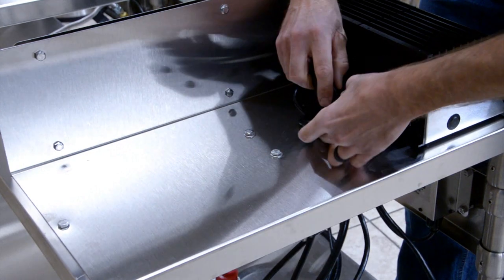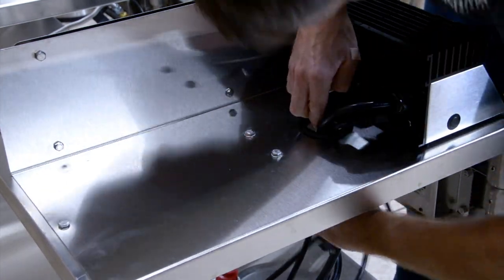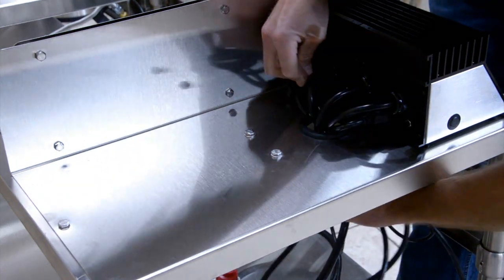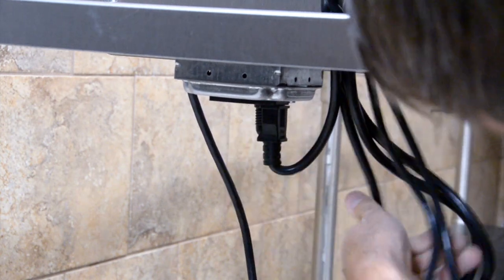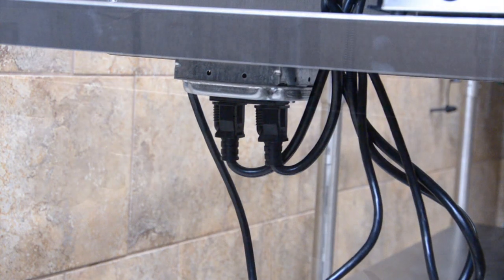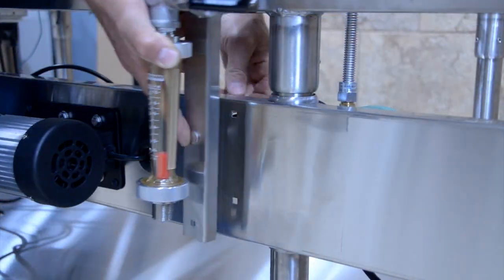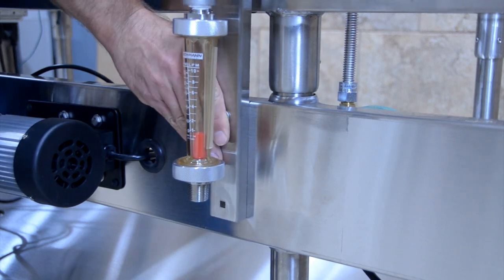Plug the left Riptide into the left Brew Commander. Plug the right Riptide into the right Brew Commander. Reinstall the grommet. Plug the 120 volt power cable from the Brew Commander into the electrical box on the bottom of the controller mount assembly. Mount the liquid manifold to the center of the apron with the 1-inch carriage bolt and close with a nut.